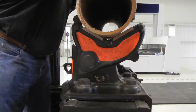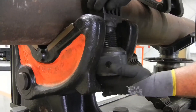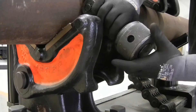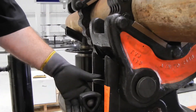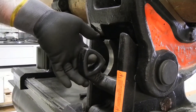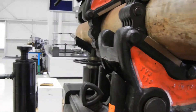When adjusting the chain on a P-TOL tong vise, begin with the adjusting nut near the end of the chain screw, flush to one quarter inch up. Depressing the pawl latch, release the pawl and move it up to the unlocked position. The chain will now slide freely through the vise.